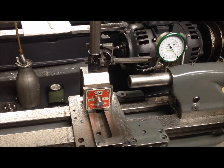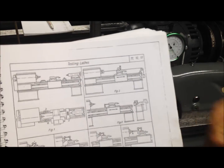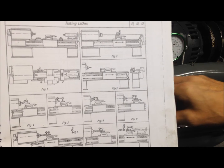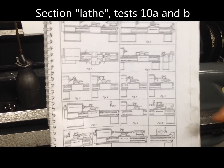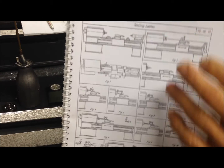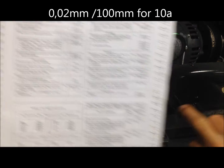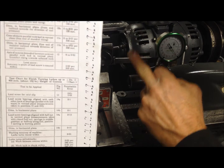Schlesinger has two tests suggested on the tailstock. At least one where you measure riding the needle on the saddle — the indicator on the saddle to the rear — and then it should rise to the front. It should rise with up to two hundredths per 10 cm. Assuming this is 10 cm, it's shy of that, but it should be maximum two hundredths high there.